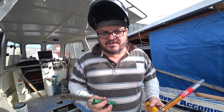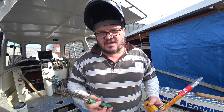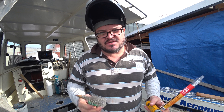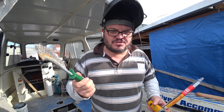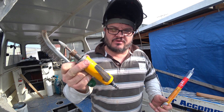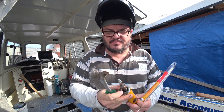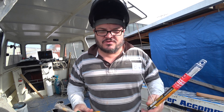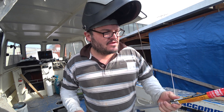Before we get into it, we're cleaning up the area. The aluminium we're welding is 5083 - it's marine grade aluminium. We're giving it a clean up with a stainless steel wire brush, and we've got a little die grinder with a tungsten carbide tip to clean it up further. The filler rods we're using are 2mm 5356, which is compatible with the 5083.